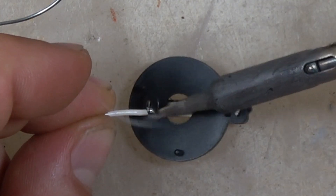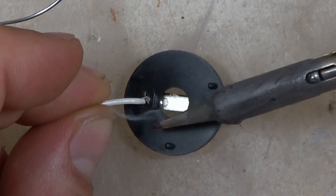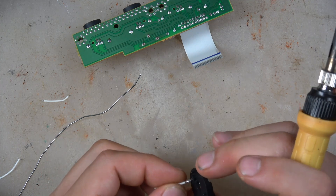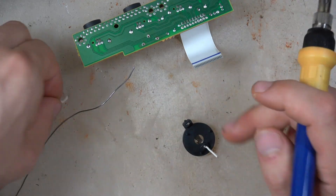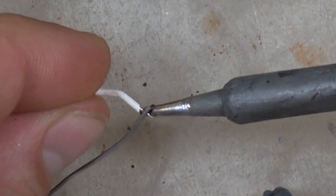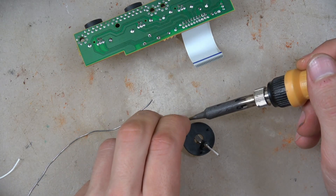After the wire and the battery connections are tinned, you just flow them together. You got to make sure you have a good connection. Anytime you make a solder connection, try to pull it a little bit to see if it comes off — it's a good way to know if you have a good connection or not. If you can physically pull it and it stays, that's how you know.